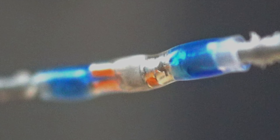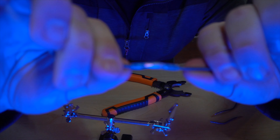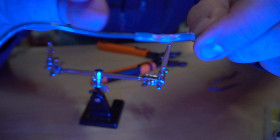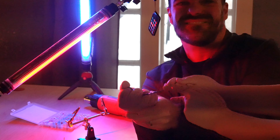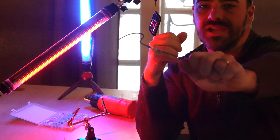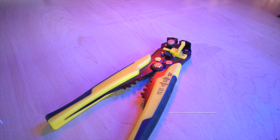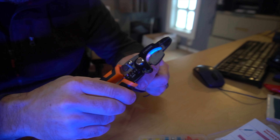You could use a butt connector with shrink tube and heat it, but that's still not as good as soldering. The best way to get a waterproof and really strong connection is to solder. Normally you'd get a solder gun, plug it in, heat it up, solder the wires, and then still put a piece of shrink tube over it — a bunch of extra steps. You don't have to do that anymore, because there's this really cool product called waterproof solder seal wire connectors — everything in one.